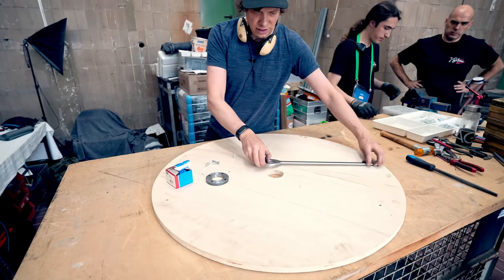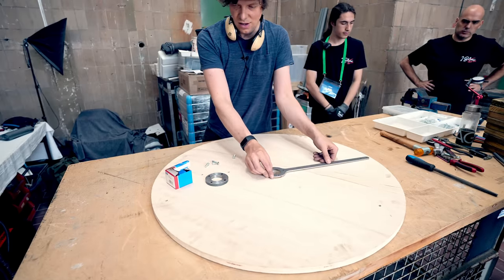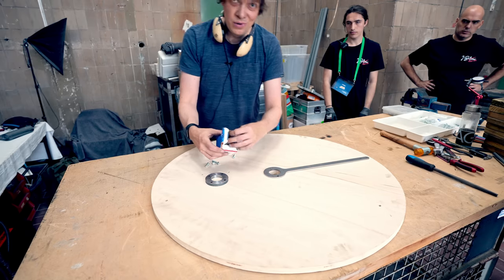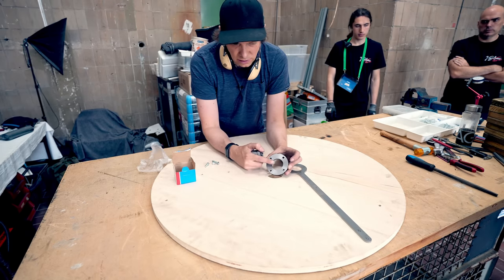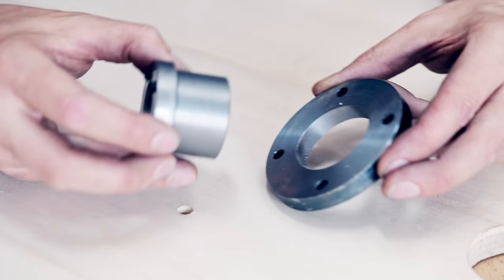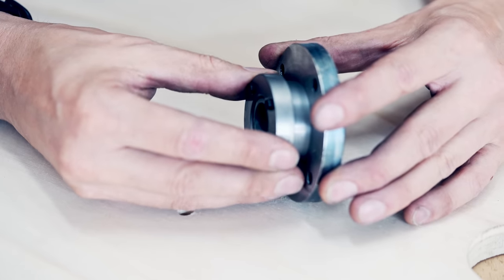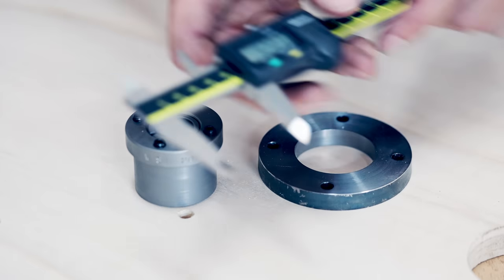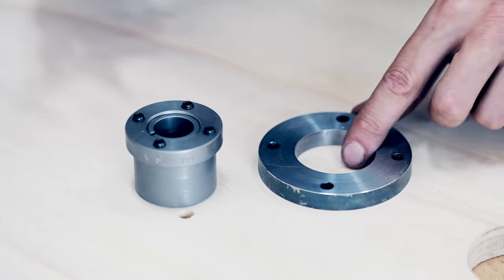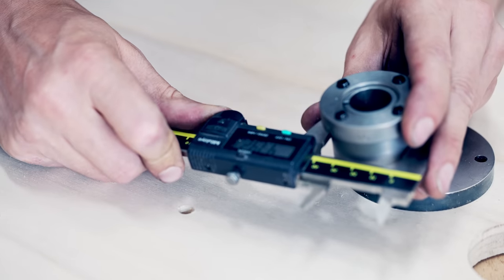Here's the clock. I was thinking about how to put the arm onto the shaft, and of course: tapered bushing, which is the theme of this design. In day two we lathed this part on the small lathe in the machine shop and achieved a really nice tolerance — 4207 on this one and 4192 on this one. When I tighten this down the taper bushing will grip the edge.